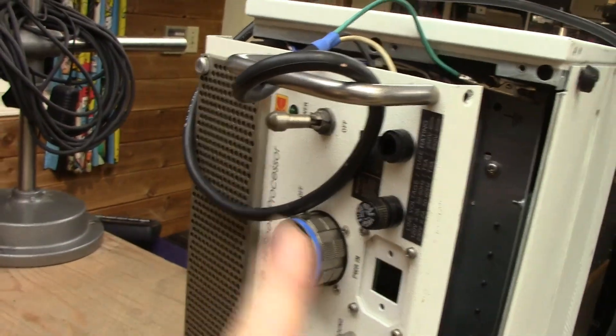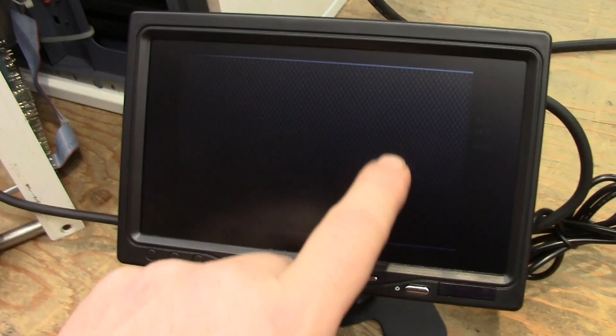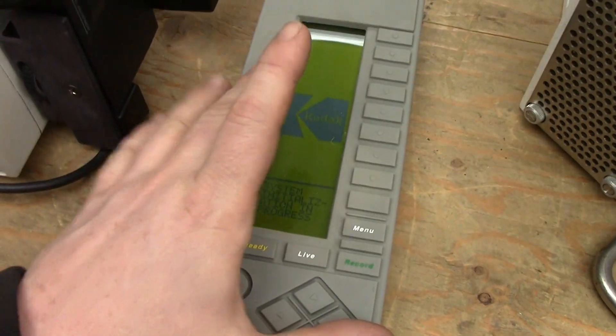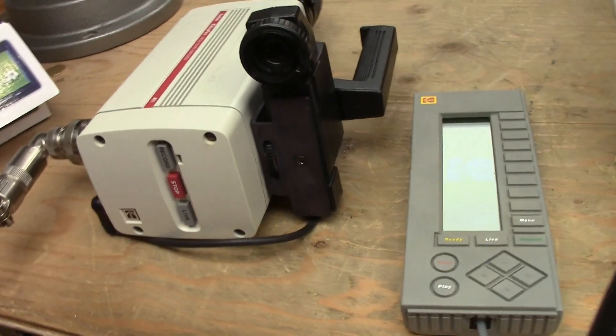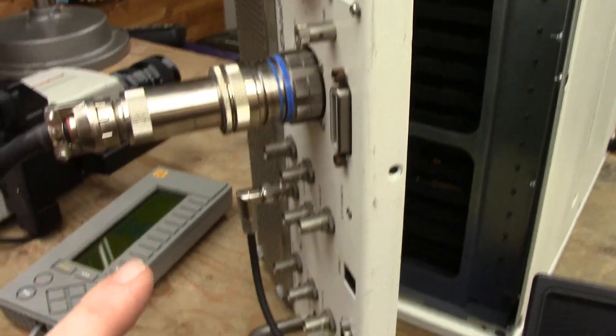There's no LED though — maybe the LED is actually bad. Let me attach an imager and see what happens. There is something going on — I'm getting this weird chain-linking corruption on the screen. The keypad's connected and it's stuck in 'system initialization in progress,' so this is powering up but I don't think it's communicating with the imager. I don't have anything on the CRT. There's no power going to this — no LED, it definitely feels like we're missing volts somewhere. I should turn this off before things start exploding.